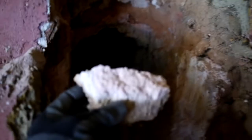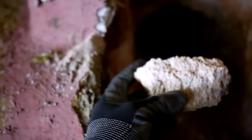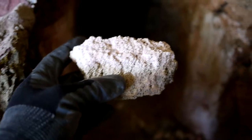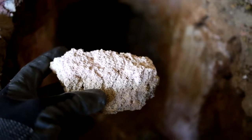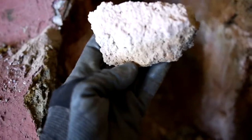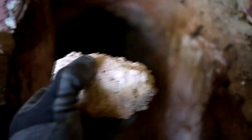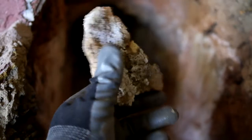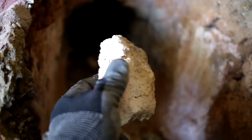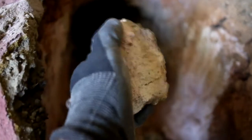I hit a piece of the original casting material — this was just clay and perlite and it's been on the burn tunnel for three full winters. This is before I started using furnace cement and before I started using fiberglass, so it's a really primitive mix. The perlite is mostly gone but what I'm left with is this really light, sort of clay foam. I'm trying to break it with one hand and I can break it, but it is really quite solid — it feels like pumice.